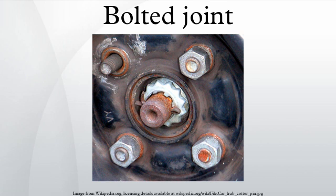To achieve the benefits of preloading, the clamping force must be higher than the joint separation load. For some joints, multiple fasteners are required to secure the joint. These are all hand-tightened before the final torque is applied to ensure an even joint seating. The torque value is dependent on friction produced in the threads and under the torqued bolt head or nut and the fastened material or washer if used. This friction can be affected by the application of a lubricant or any plating applied to the threads, and the fastener's standard defines whether the torque value is for dry or lubricated threading, as lubrication can reduce the torque value by 15% to 25%. Lubricating a fastener designed to be torqued dry could overtighten it, which may damage threading or stretch the fastener beyond its elastic limit, thereby reducing its clamping ability.